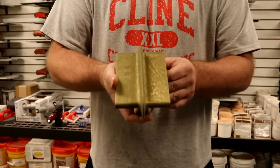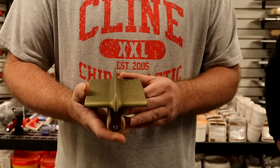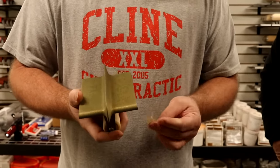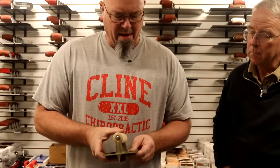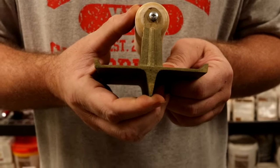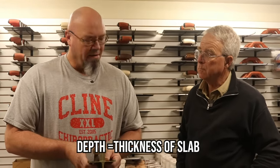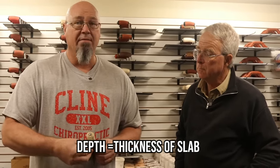Then you have joiners. These are typically brass. They come in zinc, stainless, and various materials, but our preference is brass. The big thing is not only do they visually look different because of the different width and shape, but also the depth is important because structurally this needs to cause a crack in what you're doing. The further down it goes, the more likely the crack is to form there. You want to be about 20% of the depth in a perfect world. A very shallow joiner would be a very nice decorative strip, but it would have no structural value.